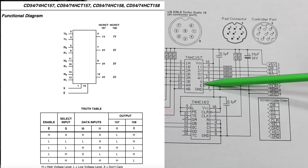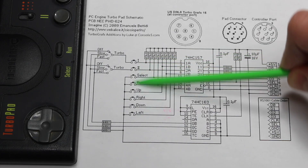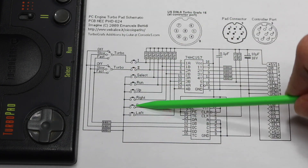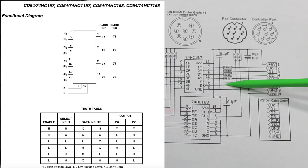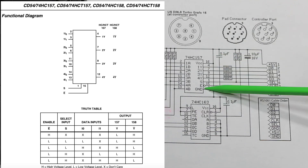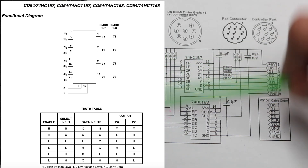Whether the select pin coming from TurboGrafx is high or low, it will route one bank of four buttons to the four data lines or another bank of four buttons to the data lines. So when TurboGrafx wants to read a certain bank of four, it sets the select pin one way and it knows what data will be arriving on those pins. The clear is connected to an active-low enable on this IC. When clear is low, it passes through whichever bank of four switches are currently selected. But when the enable goes high, it forces all outputs low regardless of what the switches are doing.